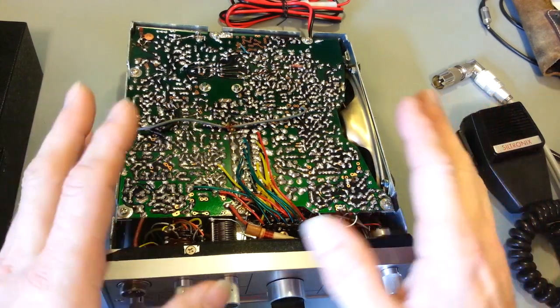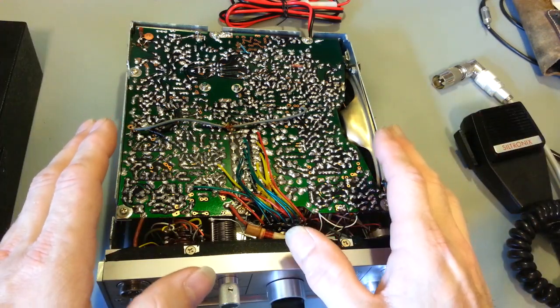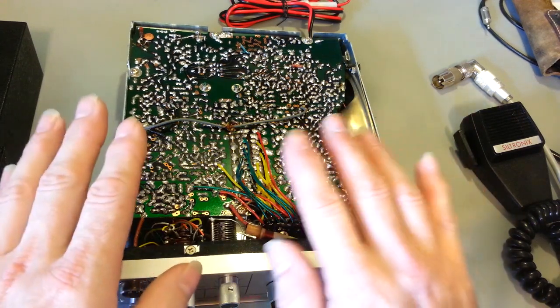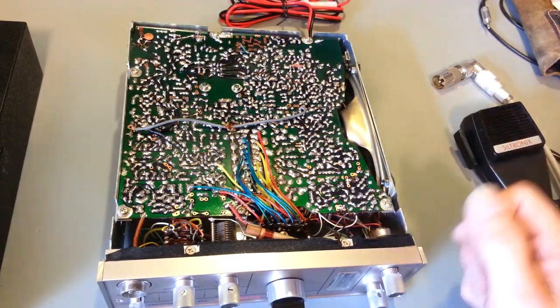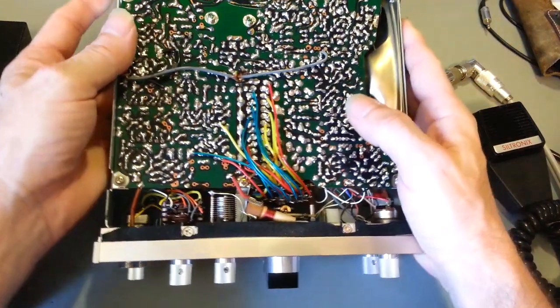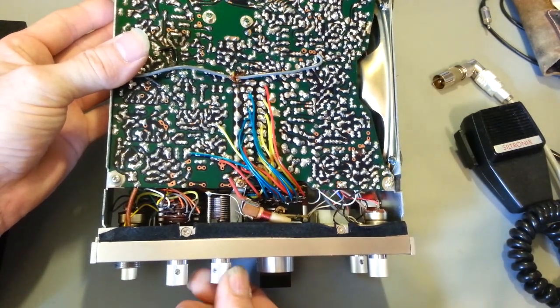And actually that makes it very nice for this because this is a sideband radio, and you got to remember, it's not PLL synthesized, it's crystal controlled. So if you get two crystals starting to drift off, yeah, you could end up with a completely useless radio. It's something like this that's crystal controlled. So what they actually have, it's not a potentiometer, it's actually a potato slicer, or air variable capacitor.